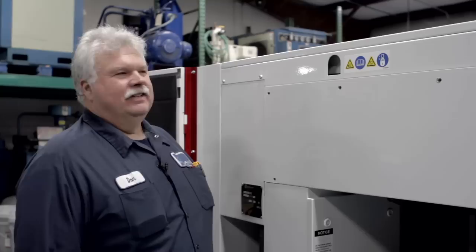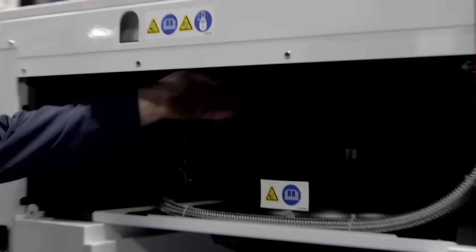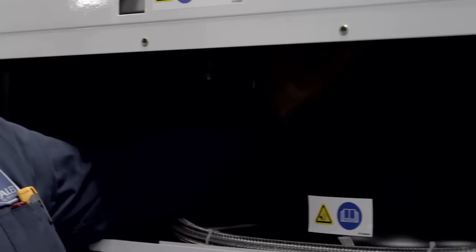Inside of this panel is one of our cabinet elements and our air and oil coolers. Remove the panel. Up here are our air and oil coolers — get compressed air hopefully from another source, get in here and blow all your dust and debris out of the cooler. Make sure it looks good and clean; otherwise it's going to affect how hot your machine runs and can also affect the life of your oil. Over here is one of those cabinet filters — it pops out, there's an element in here. If it's not too dirty you can blow it out; if not, change it. There are two cabinet filters total. Put your new filter back in and put your cover back on.